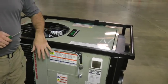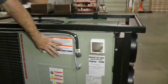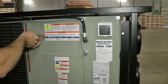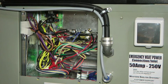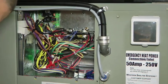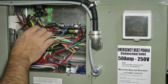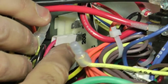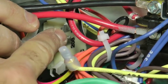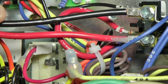To change between 208 volt and 240 volt operation, detach the panel with shock hazard warnings located next to where the power cables come out of the unit. Be absolutely sure the unit is disconnected. Inside, locate the red wire with white clip running to a transformer with two leads printed 208 and 240. When using a single phase generator, locate the wire on the 240 volt connection. When using a three phase generator, connect to the 208 volt connection. The unit comes preset to the 208 volt connection.